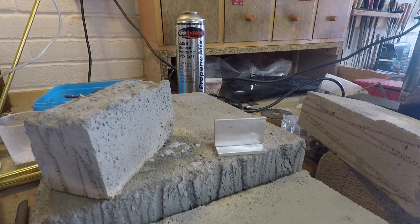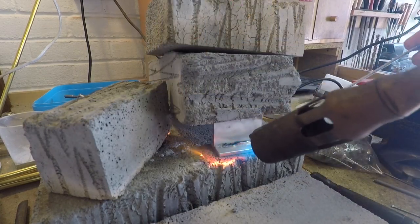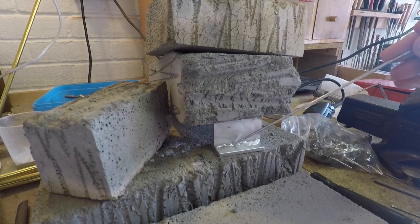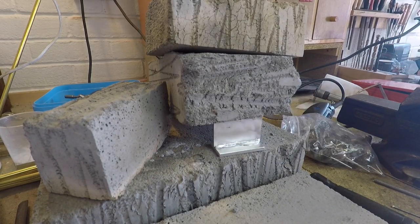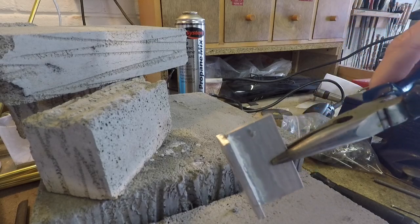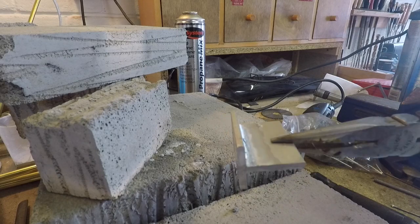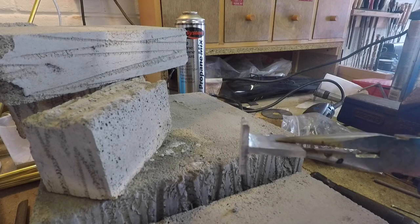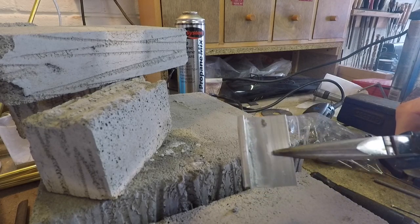There's no evidence of the material flowing through the joint by capillary action — it's just stuck to the other side. So I'll reheat the work and apply more filler from this side. That was pretty easy. Not the neatest joint I've ever seen, but I was quite surprised how quickly I was able to heat up the aluminium to get the material to flow. What I can't tell is whether the solder has actually flowed into the gap, so I'm going to cut this in half and see.